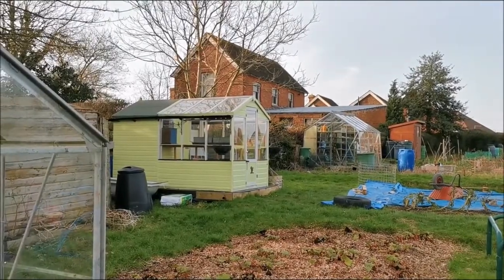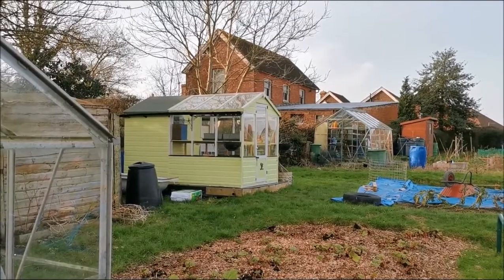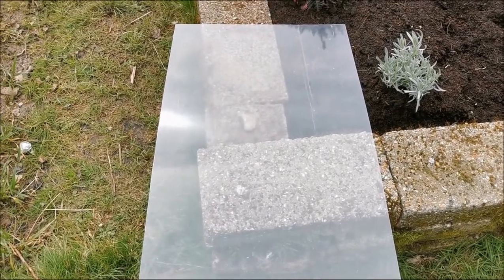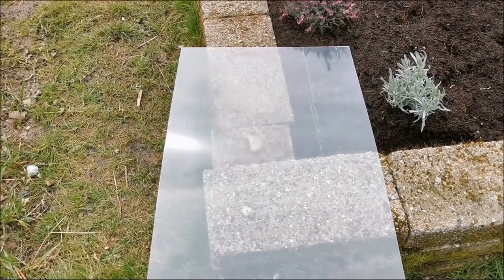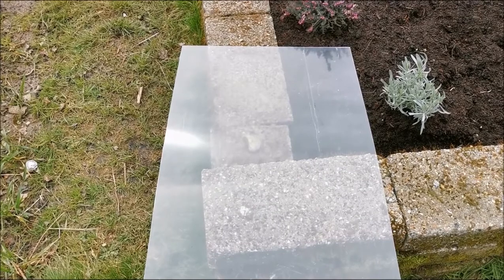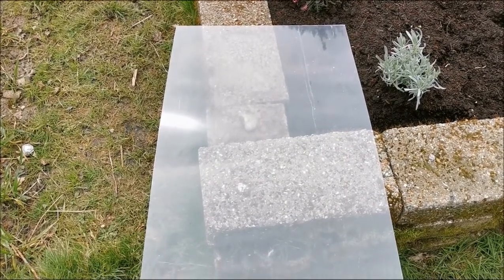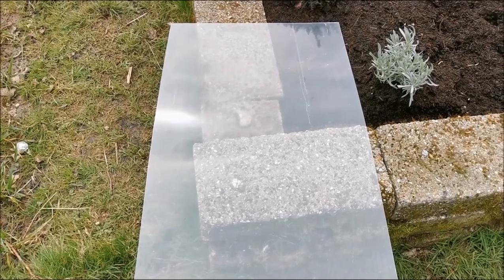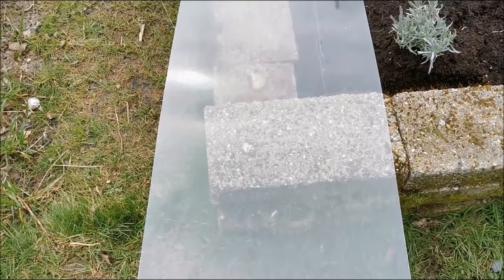Let's look at measuring up for the new pieces. That greenhouse over there is Charlotte and Christian's, and they had some polycarbonate left over and gave us some. This whole sheet doesn't quite go up the full length, so I've put a mark where we need it and I'm using a spirit level as a straight edge to draw my line. When I went to cut them it suddenly occurred to me that these aren't polycarbonate — they're perspex. Given the choice I would go out and buy polycarbonate because it's cuttable with scissors, but perspex is not, so we had to use a super thin blade on a jigsaw to cut these to the right shape.